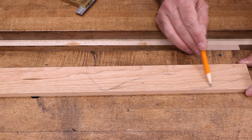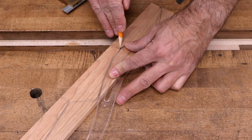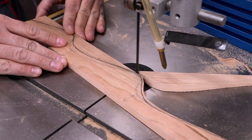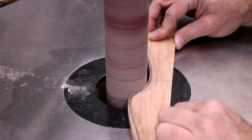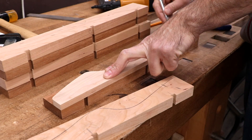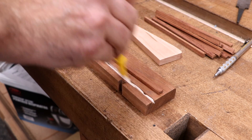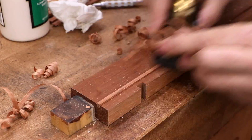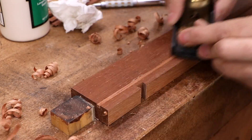Using a piece of scrap, I can make a template for the curves. I'm really just trying to make it look similar to the one that my mom wants. The curves are then cut at the bandsaw and then smoothed at the spindle sander. I can then transfer the shape to the rest of the ribs. Because it's flooring, some of the Brazilian cherry has grooves that can be seen from the ends, so I'll just glue in some strips, flush them to the surface, and make sure that those sides face inward in the final arrangement.